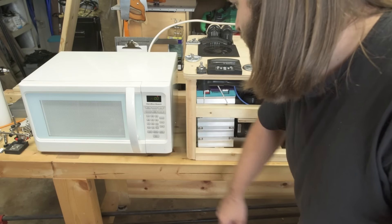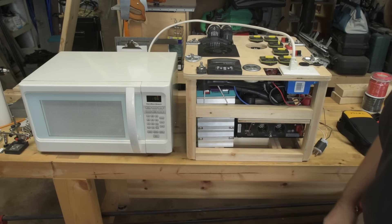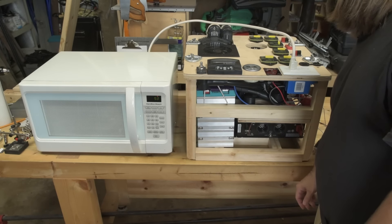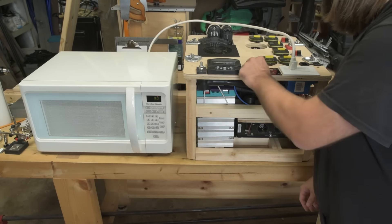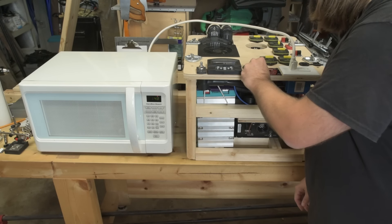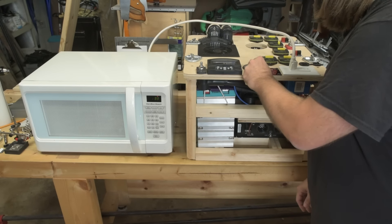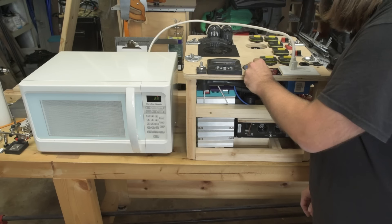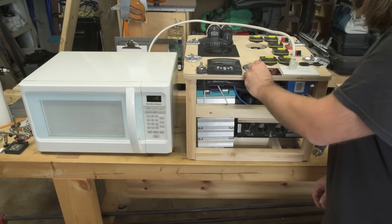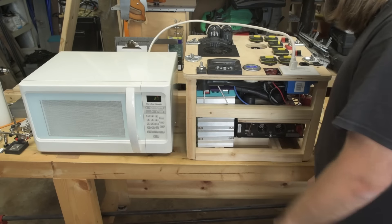Put it on for a minute. Holy crap, there it goes — that is drawing 1.85 kilowatts. Wow, that's impressive. My voltage is down to 12.53 volts and I have a half-hour run time but it's going down. It takes a minute to adjust and it is drawing 145.4 amps — 146 amps. That is impressive — that's almost enough to trip my 150-amp thermal breaker. 1.8 kilowatts.